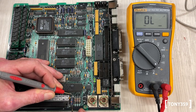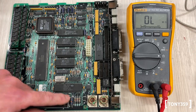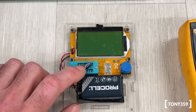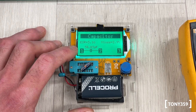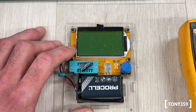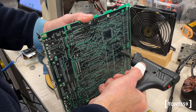Removing these capacitors will take me half an hour. I don't necessarily like replacing all capacitors but let me try removing at least a couple and see what they read. The one that didn't read anything on the meter is out — this is supposed to be 33 microfarads and it reads 38, which is within the 20% spec. ESR might look high but for this value and a 1990 capacitor it's probably totally fine. Let's go ahead and replace these capacitors anyway.